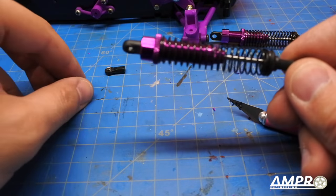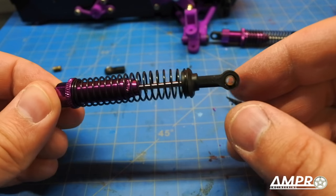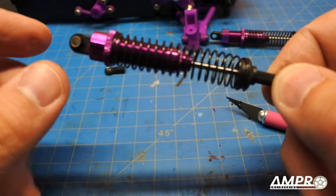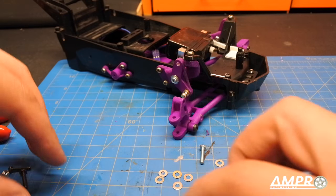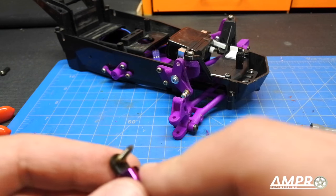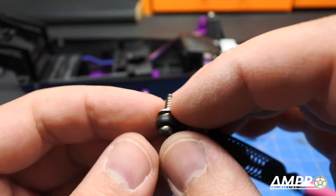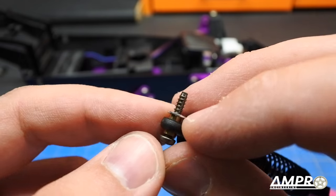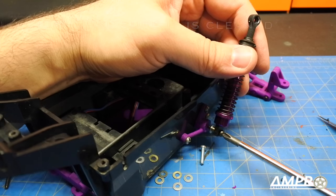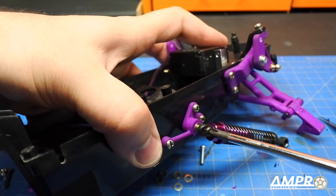You don't need any more slop. For these shocks they also could use one of these little guys at the end to help reduce the amount of play. So let's install this. This is going to use an M3 with a nut on the back side of it, and this here is going to need a self-tapping screw. I'm going to start off by installing the back side of the shock absorber — I'm going to take a self-tapping screw, this one is 16 millimeters long. The reason why I'm putting a washer on the inside is that I want to make sure the washer is what stops the screw from digging into the plastic and not simply have that sleeve cutting into it. For this hole here you do not need to drill it — just tap it straight in, and when it stops, it stops.